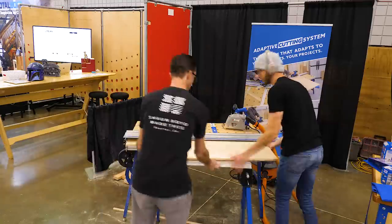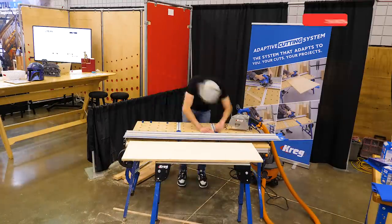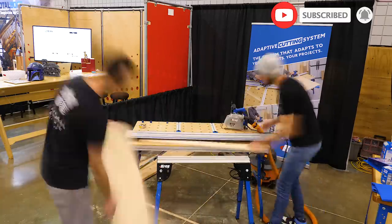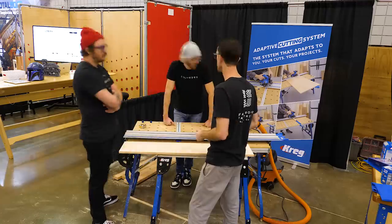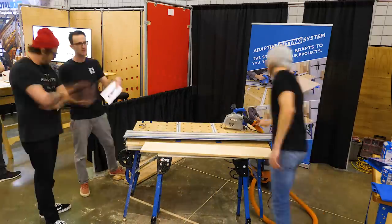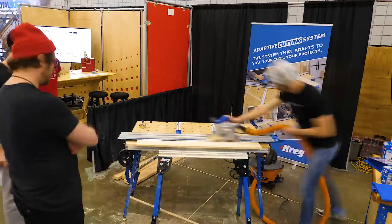Here I'm ripping a bunch of those 46 and a half inch pieces to their finished widths. From this sheet I'm going to get 3 shelf back pieces at 9 and 5 eighths inches, two shelf bottom pieces at just over 3 inches, one thin strip for a front ledge at basically half an inch, and finally a third bottom piece that we're going to leave wide for now because it's going to need a bevel on it.